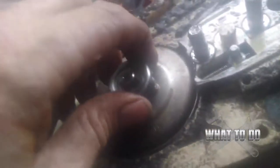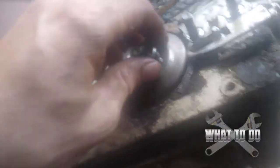When you're looking at your spur sprocket, look for grooves in there — if it's starting to wear, you may want to replace it. It's actually really simple. On some saws the sprocket is separated, but on this one it's all one big cover with the sprocket attached.